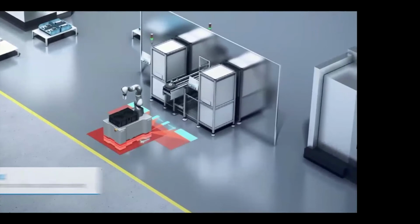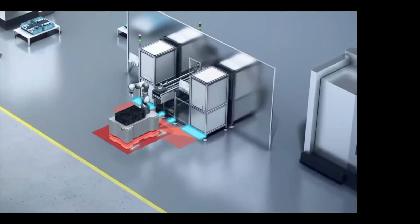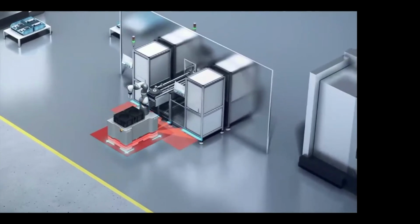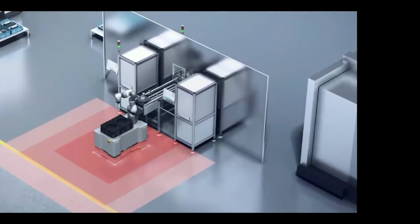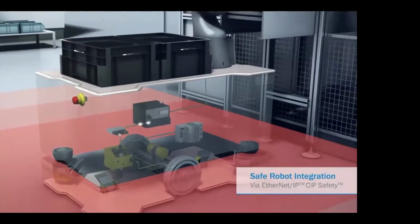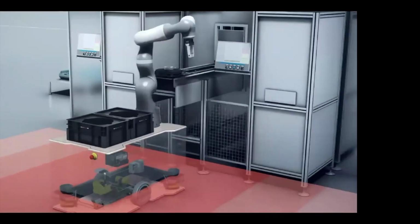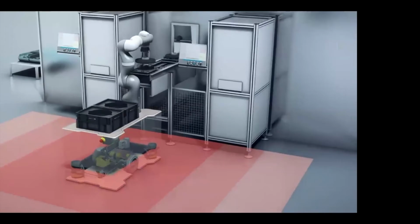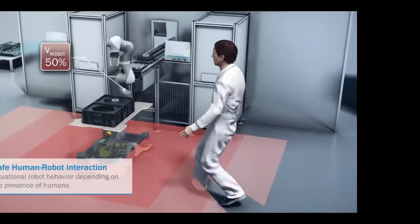So if something is approaching a machine, or a basket is being brought towards a robot and it needs to be in the spot before I do a picking, we can use the scanner for that, and it can change a case, saying, yep, I pulled up to the machine. I'm doing my work, it changes its case, it changes its field sets to protect around that machine and the product itself.